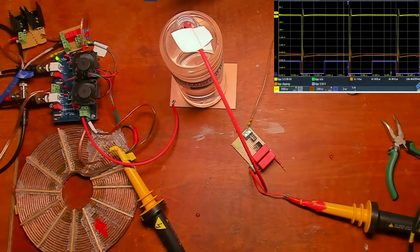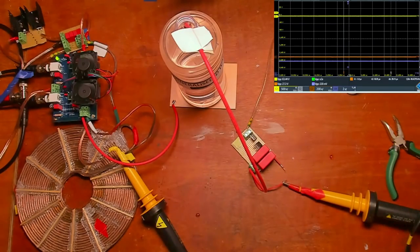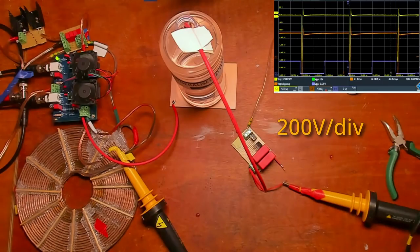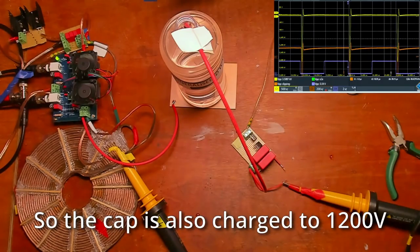It is filled enough — I'll turn off the system and now discharge it with a spark and a bang. I'll do it again and charge the system up. Notice how the orange is now dropping. The voltage division is 200 volts per division on the orange line and 500 volts per division on the yellow line. The yellow impulse is minus 3000 volts and the orange impulse is around 1200 volts, but it is conducted through the water, which is rather unique and special.